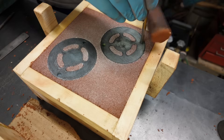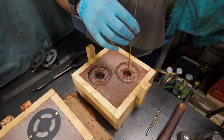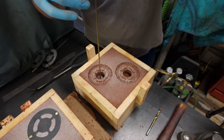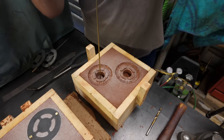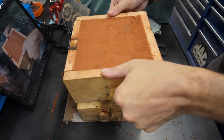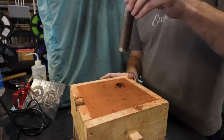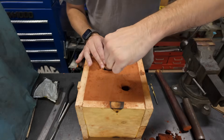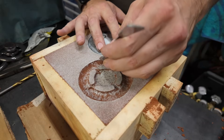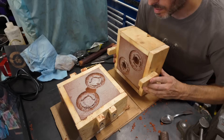Ramming up the second half of the mold is the same as the first, so we'll skip through that quickly. We're moving on to what is definitely the scariest and most difficult part of making this mold — putting in the risers. I remove one half of the pattern and push a brass rod through the center to make a couple of marks on the other side of the sand. Then I put the pattern back together, and I can see those two marks on the other side to locate my two risers. I add a gate between the two sides of the mold and we're good to go.